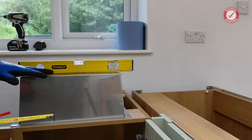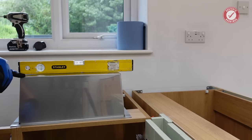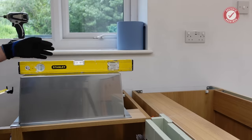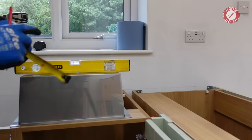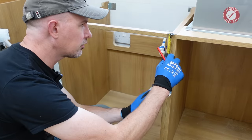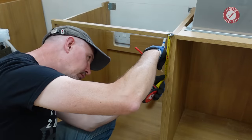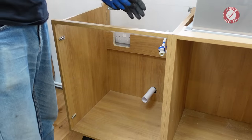Because of the angle of the bottom of the sink, it's no use measuring right at the edges to determine how high the shelf needs to be — you need to bring it in by whatever thickness your shelf is going to be. I need to allow enough room for the waste cutout. I'm going to allow 65mm and that gives us 180mm, so I'll put a mark 180mm down from the top of the unit, because that's what we want the top of the sink to be flush with.